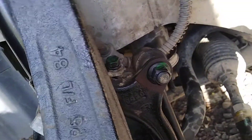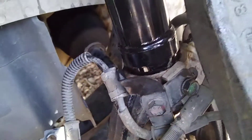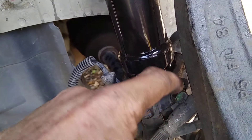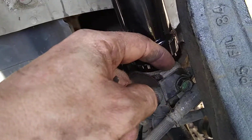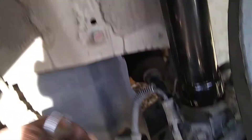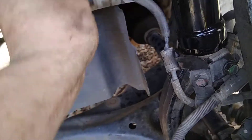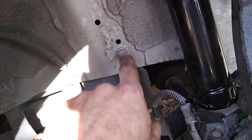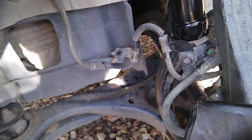Since it's kind of hard to do that with one hand — these two brackets bolt onto each other with that one little bolt. You'll notice there's a tab back there that slides into this back bracket. Once you do that, get that tightened down. Then this will come up like that, and that little tab will go into that hole right there. So that's all there is to that part.